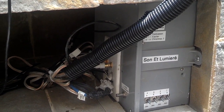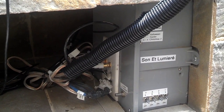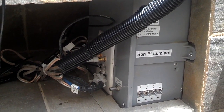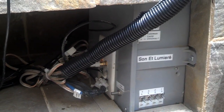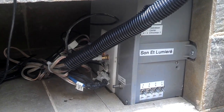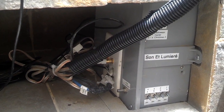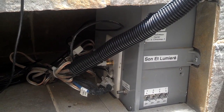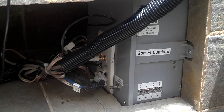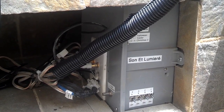The audio is pretty standard stuff — it goes in and comes out. I'm using standard Cat5 for the clock and data into the LED strip, and some heavy-duty 14-gauge landscape wiring to handle the fairly significant power demands. There are only 5 volts and you don't want a lot of voltage drop, so you need to use a fairly good cable. The little pot there is just a trim pot to level the output, although the software I wrote does have some gain control built into it.